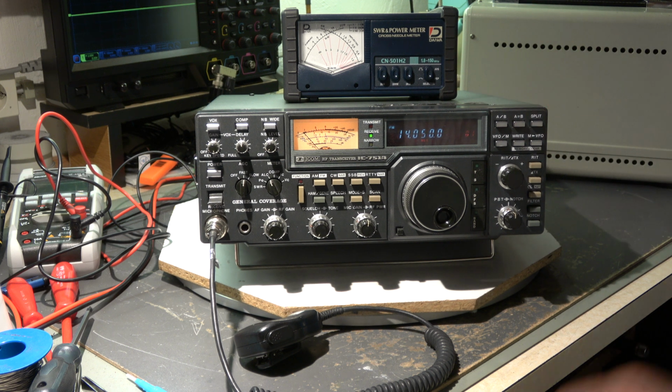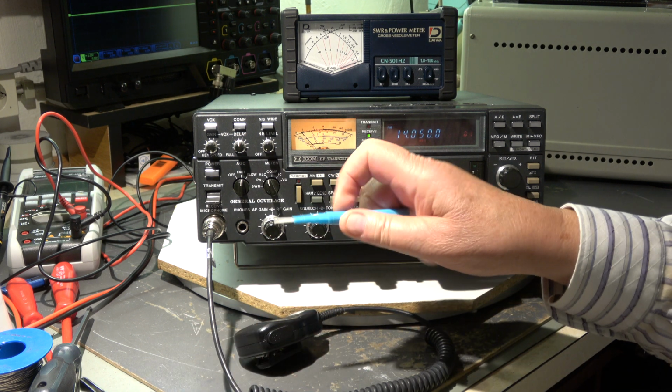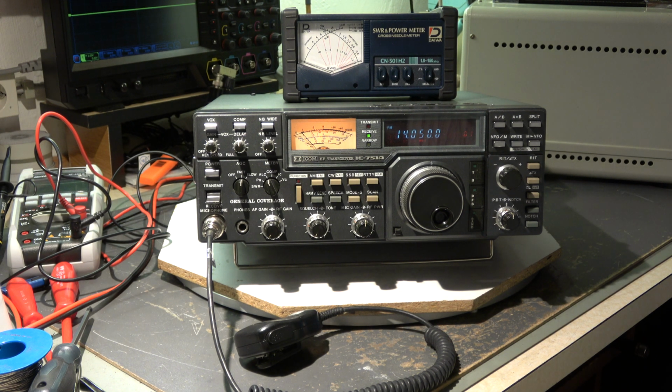We only had faulty trim caps for the VCOs. When we have such faulty trim caps, there's another solution which can be tried. Simply rotate these caps with a screwdriver and rotate them many times. Add some tuner spray or alcohol or something like this, which evaporates without residues. It could help for some time. When you want to sell it in the net on one of the known platforms, you can do this and sell it as checked and operating, and the problem will occur hopefully after some years, not earlier.